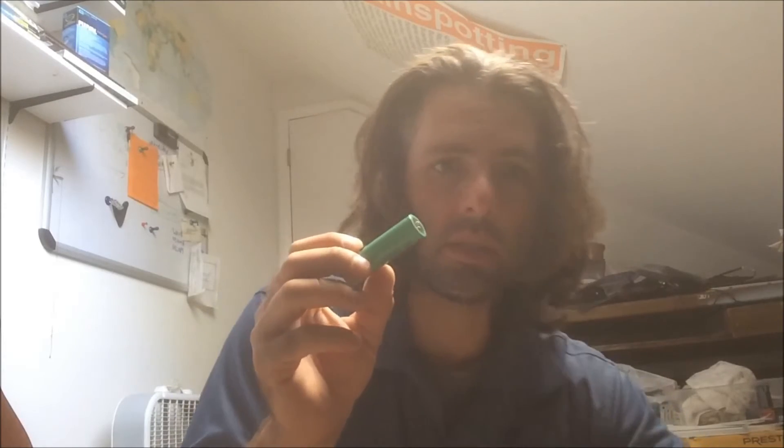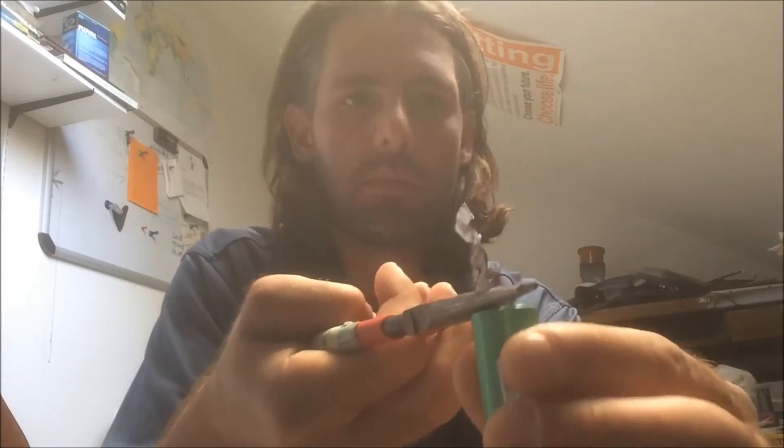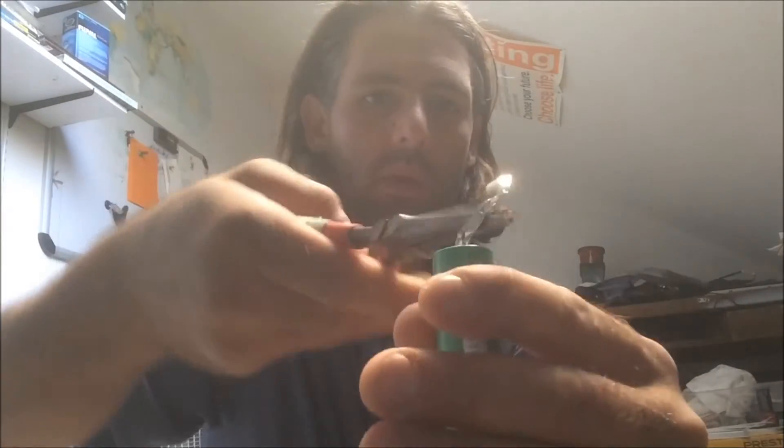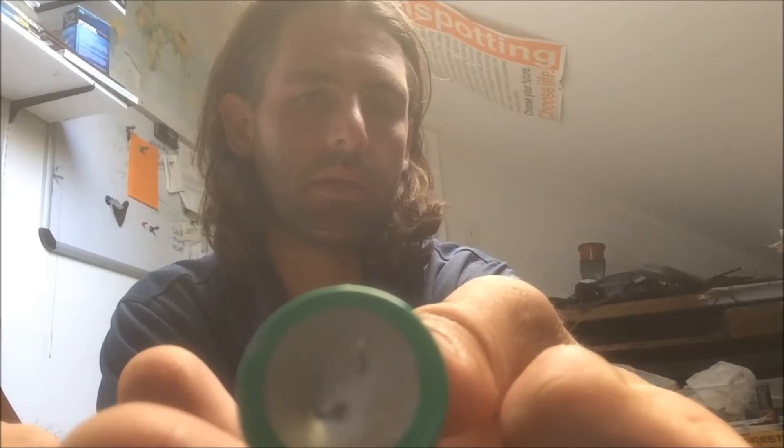Another good Samsung cell, reading 3.6. I'm pretty sure that this pack had a full charge and then somebody threw it in a corner or bashed it and it knocked the weld loose and it wasn't able to be used again, and the person threw it in the recycling bin at Best Buy. I'm not trying to traumatize these cells too much, so I'm being delicate as I work the tabs free — grabbing it and rolling it just to rip, then twisting it. They're held onto the cell by these little spot weld dots.